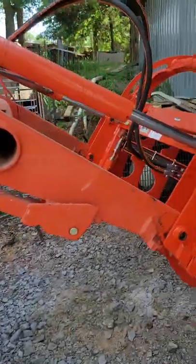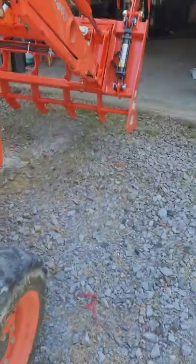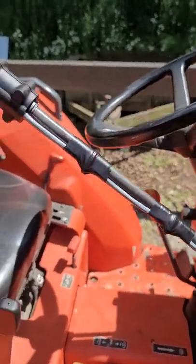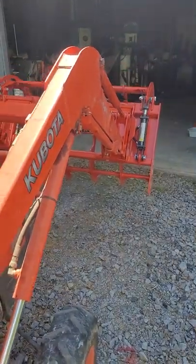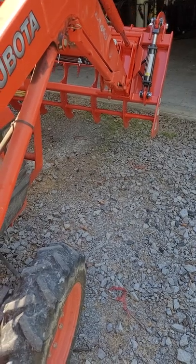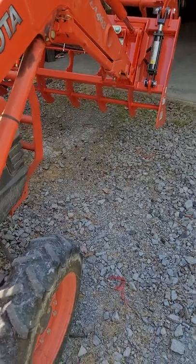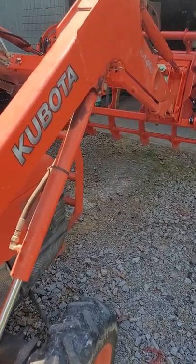It's a 2007 model, but I got the valve hooked up. I had to make some modifications. I got the new handle put on, and this is the control now — when I push this button you can watch the grapple work. So that gives it the third function, putting hydraulics on the front of my tractor for simple functions. And I still have my normal lift and tilt functions.